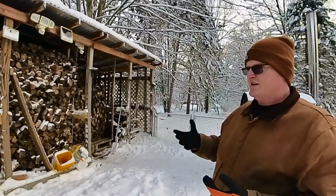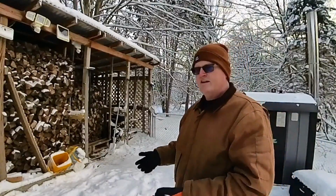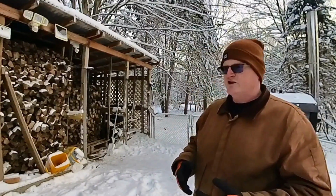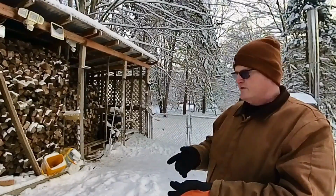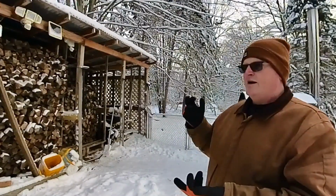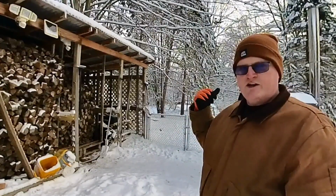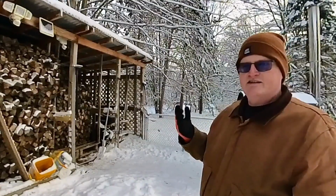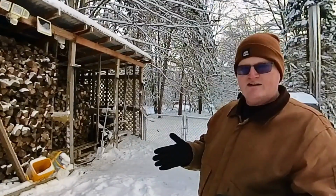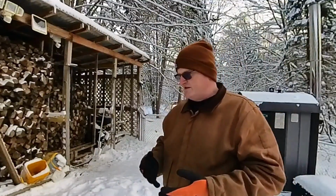It seems like once you start building it up, it keeps building up, because when it gets really cold like this, you're pulling a lot of cold air in, which is causing more condensation. No matter what, even in seasoned wood, there's moisture in the air, and when you're drawing super cold air into a hot firebox, you're going to get some condensation in areas where it transitions. And I think that primary tube is where that transitions.